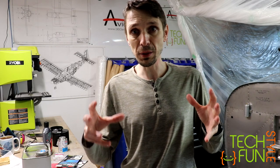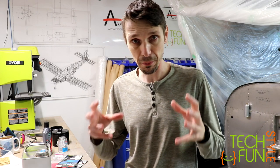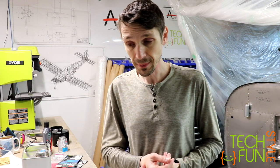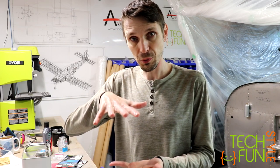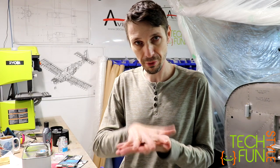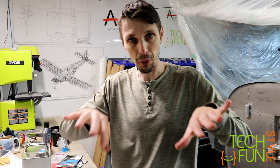I have that little, nice, beautiful vacuum pump, which you will see later. I'll be using that vacuum pump when I'm actually fiberglassing my mold inside, making a part, because we need to vacuum all the air out and push down with the transparent plastic onto the material, onto the fiberglass, remove all air, and equally fill the whole mold, right?